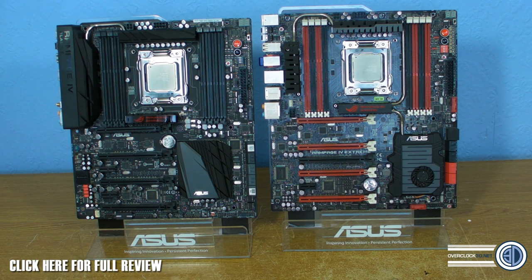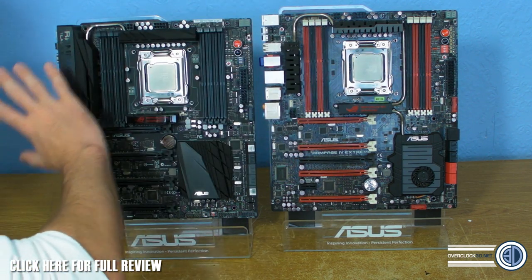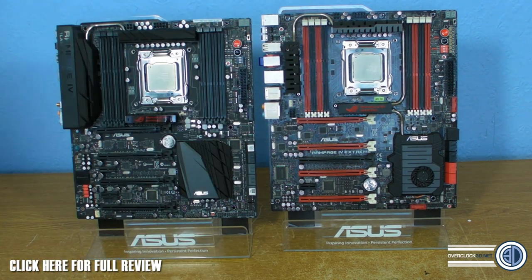If we go back to the difference between the board power wires, because I kind of skipped over it and I shouldn't have done, just to read you out some of the stuff, they've got 100% 10K black metallic caps. It's got NexFET power block for the MOSFETs, 2x the current capability of any low RDS(on) MOSFETs, while capable of greater than 90% efficiency at 15 amps. Sorry, I'm trying to read this, but the reviewer's guide is Chinglish, and it's very Chinese English, and it's not very well laid out, really.